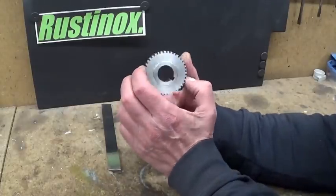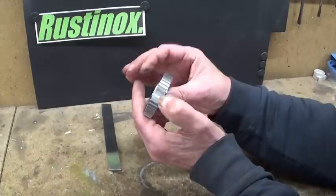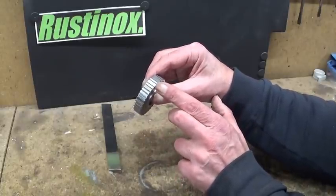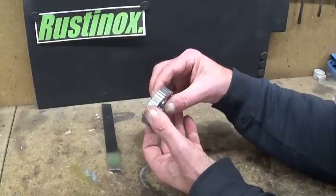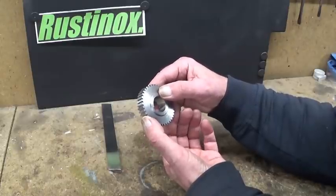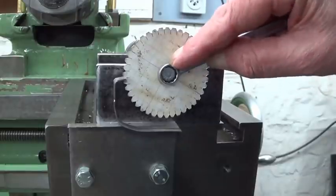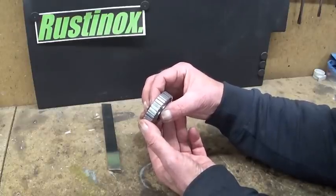That was fun to do. And now, if we look at all these teeth closely, we see that some of them are a little bit smaller than the others. This one is smaller, this one is smaller, this one is bigger. And the only explanation I can think about is because of the flexibility of the finger I used. This sheet metal is of course flexible, but it's flexible in all directions. So I think next time I'm gonna use a shorter one and more rigid.